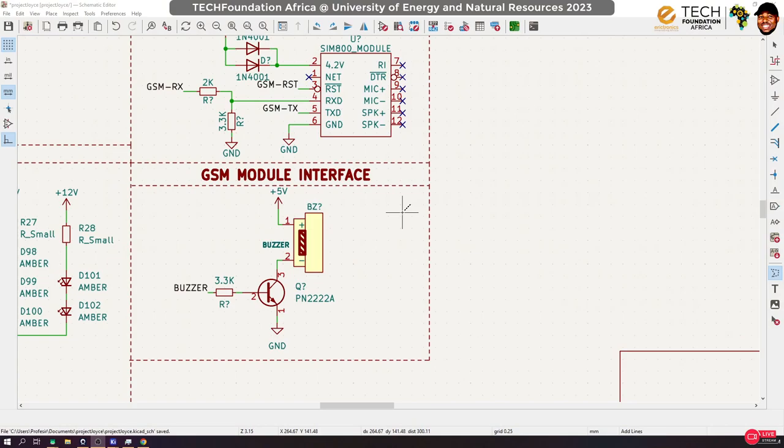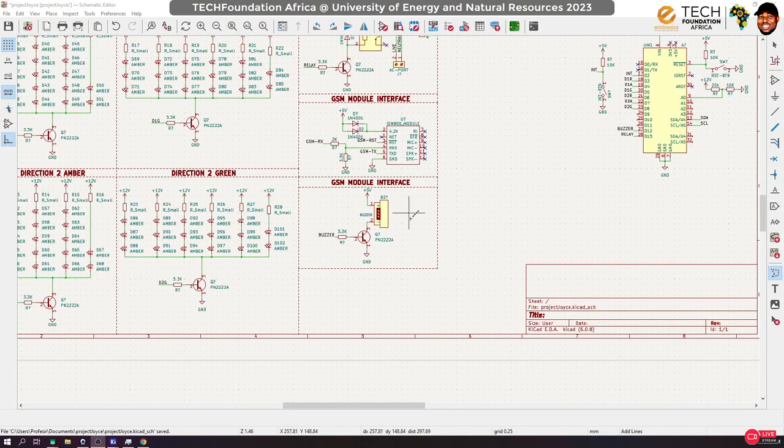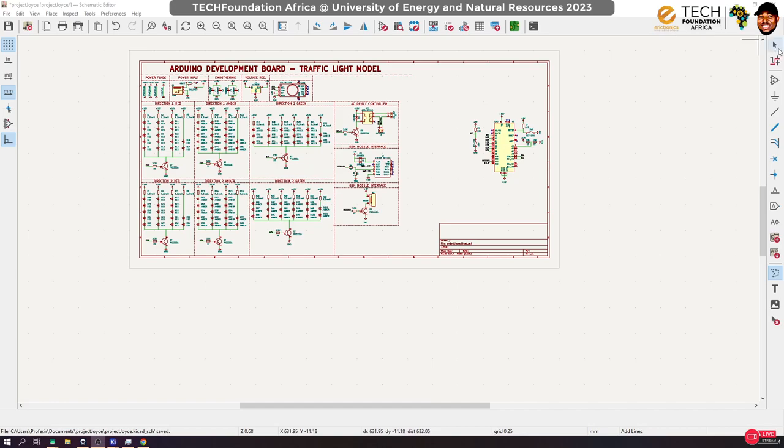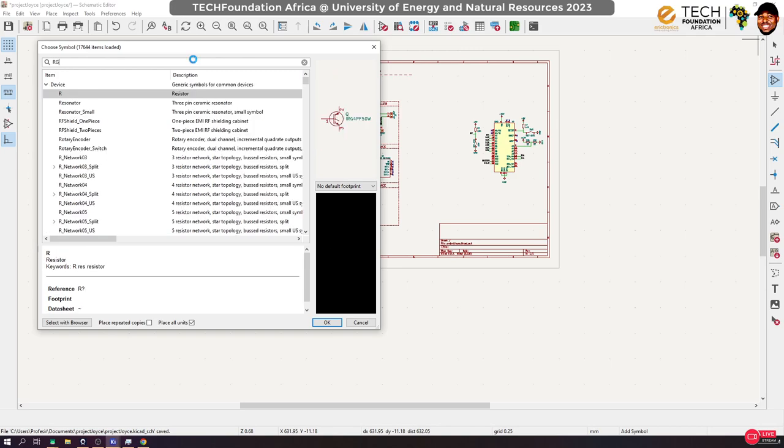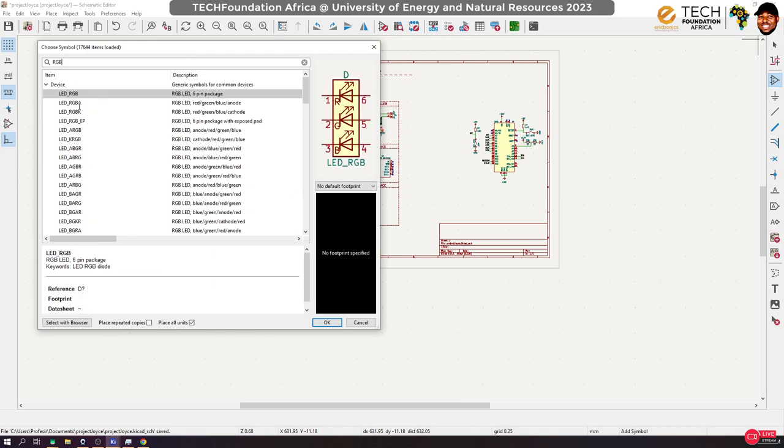All right, so let's fix one of these in our circuit so that we can use it to learn how to program PWM, right? So let's go to the library and find RGB LED. All right, so you can see RGB, this is the normal one. This particular one is not like what you have. There are six pins, okay? It's just like a container for six, but they are individual, they are independent.